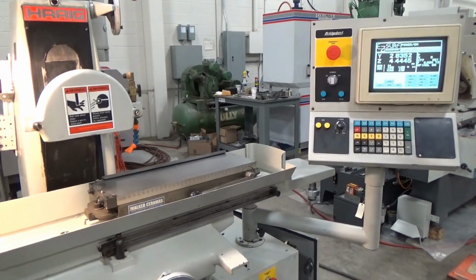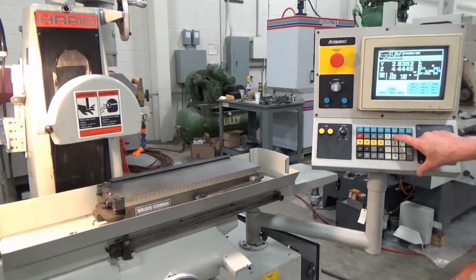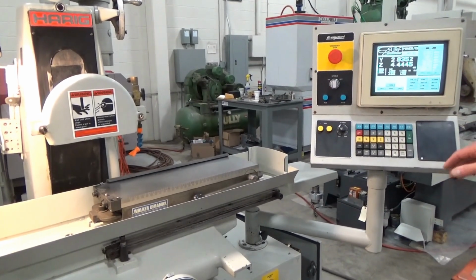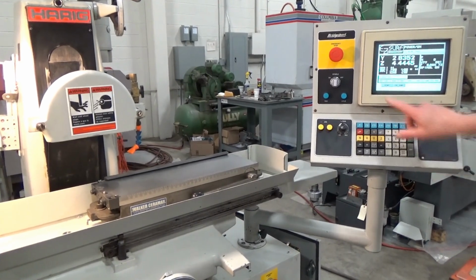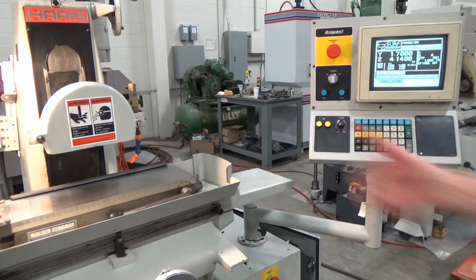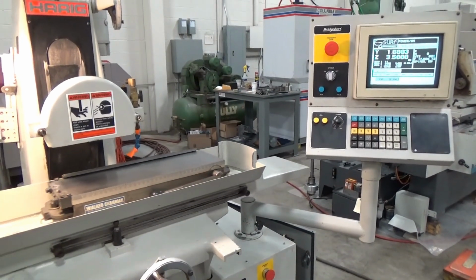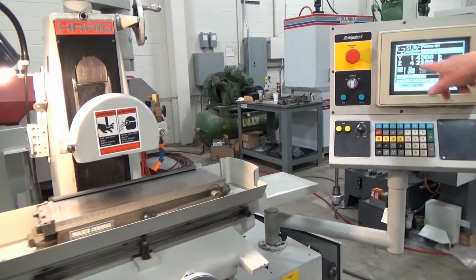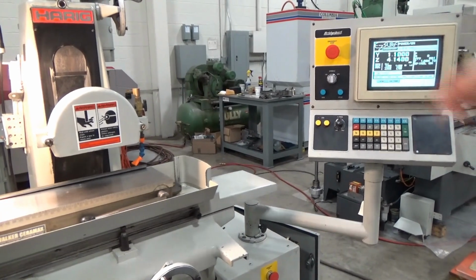We'll be all right. Okay, so same thing with traverse, actually. If we go into what they call surface in this instance, I got the same numbers on that, and the same thing happens in reverse, though now it's a traverse grind. So we'll walk through all that, enter that up. Happy, start, and we go. Now we're doing a traverse grind, just the opposite, but same numbers. We'll go to 1 inch and 4.5. We don't have far to go. Another 100, we're done.